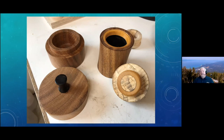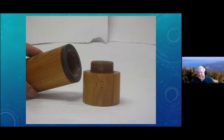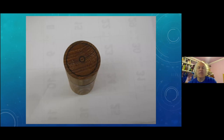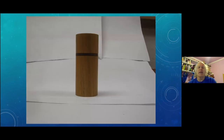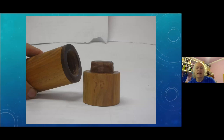Gary, closing out — and then Vern Stover. The box is made out of unknown wood I've had for some time. I tried cutting threads in it — it would cut but would leave little chips, so it didn't look very good. I had some ironwood so I cut the threads out of that, made inserts, and put it in there. Off the top, I used the chatter tool I made with a sawzall blade and a holder. It turned out pretty good. The threaded part was made out of ironwood. Very nice — thank you.